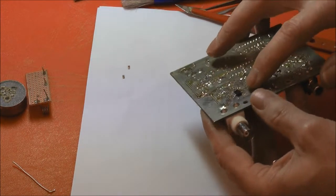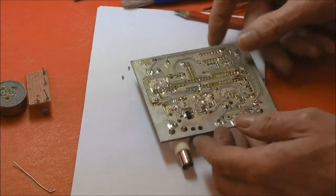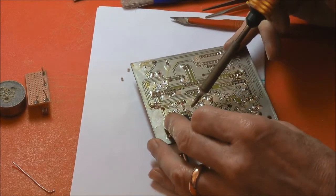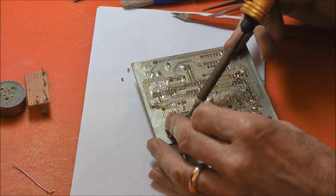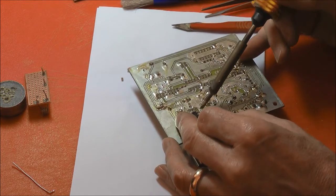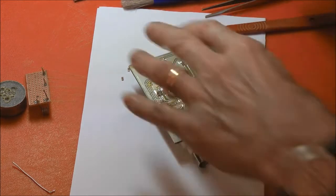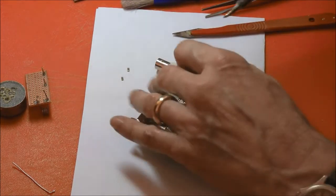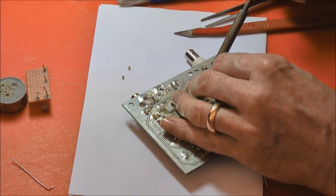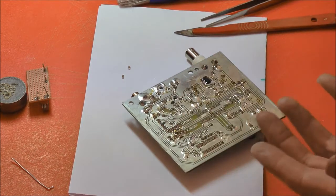So we've soldered one lead down, so now it's not going to go anywhere. So we can then follow on and solder, hopefully, the other lead. We don't want a lot of solder, and these don't take a lot of time. Here I'm having to turn the iron sideways because the tip is wider. We don't want to put heaps of solder on, just enough. Similarly with this, we just want a little bit to get in there, and then it should feed in from the edge like that, and that's it.